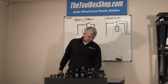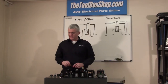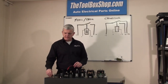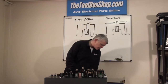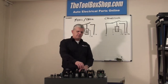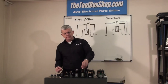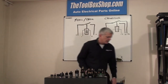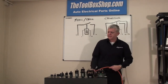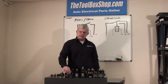For example, I have down here in front of me a small light duty wire — obviously with crocodile clips on the end — but this is the type of wire you'd use to wire a relay up with. If we were to go down the avenue of wiring in one of these, bear in mind this SW200, the biggest of the lot, at 70% duty, we'll be talking about 300 amps capability. So we'll be talking about cable bigger than this. This will probably be suitable for the SW60 or the SW80.